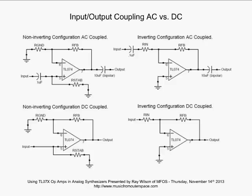Again, only AC signals coming in, only AC signals going out through our 10 microfarad bipolar capacitor. Oh, also bear in mind, these bipolar capacitors are made with electrolytic capacitor technology, but it's almost like having two electrolytic capacitors in the same can with their negative sides connected together and their positive poles coming out as the leads, which is a little trick you should know.